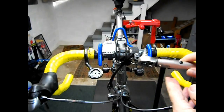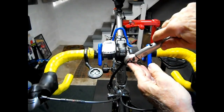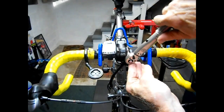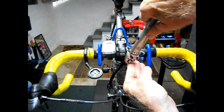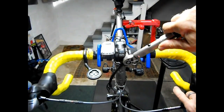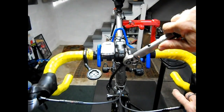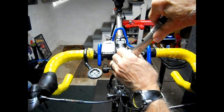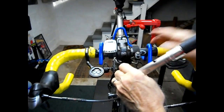So I've set the wrench by turning the handle to just below 6 — a nice in-between range. I engage it and turn it, and as soon as I hear a click and feel it, I immediately stop and know I'm at the correct torque.